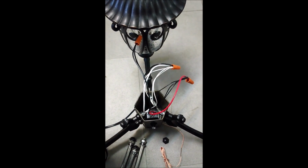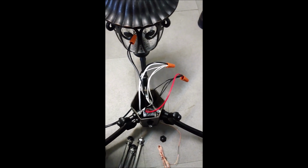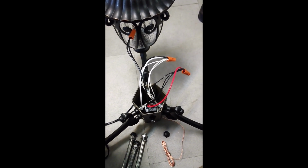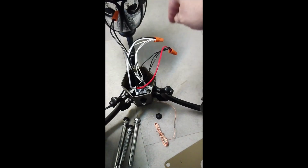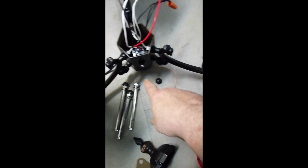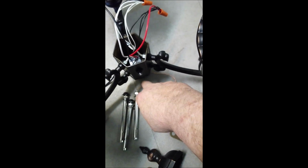All these white wires are the return wires. In residential lighting, residential electric, period, black is hot, white is return. And what we've got going on here is this is your return line. This is your main hot line. This goes into the switch, the UV switch, which uses ultraviolet light to turn it on or off.